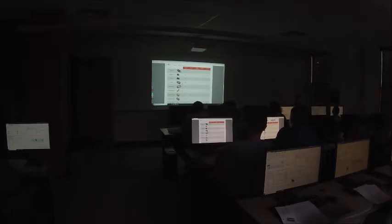I don't know completely. I think an easier way to answer that question would be to answer why I think they removed the limit. Why they removed the limit, I think, is because teams were running up against a different roadblock. So I think with the motor limits, maybe teams were running up against a cost roadblock or a complexity roadblock or maybe motor control roadblocks. So they limited motors to kind of even the playing field a little bit. But now robots are so much more powerful and they have so many more watts of power packed into all their mechanisms than they used to. The teams are running up against current limits rather than cost and complexity limits. So you're more in danger of tripping the main breaker of the robot at any one time than you are of running out of money or weight, I guess. That's the best I can answer that.